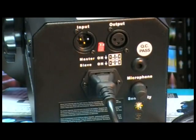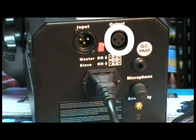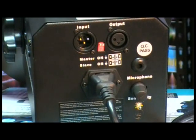As you see from the back side, you have a DMX in and a DMX out, but that is not a DMX light. That's actually to make this unit a master and any additional units a slave. So whatever this light is doing, any of the additional units you connect to it with a DMX cable will follow suit and do exactly the same thing that the first unit is doing, which is pretty awesome.